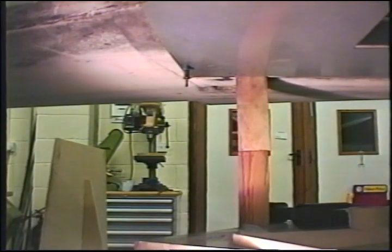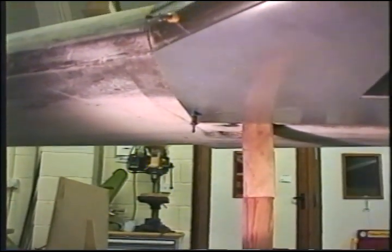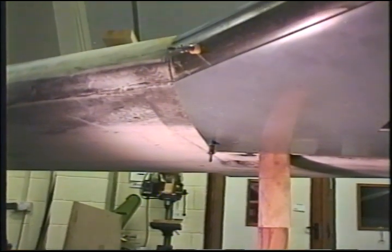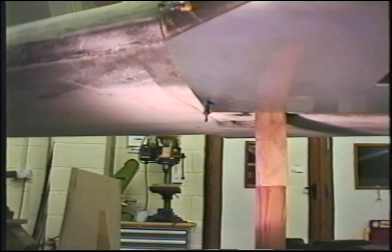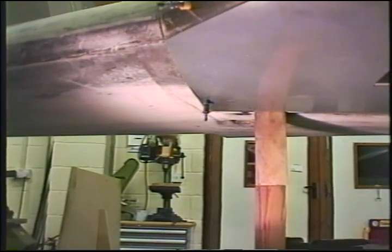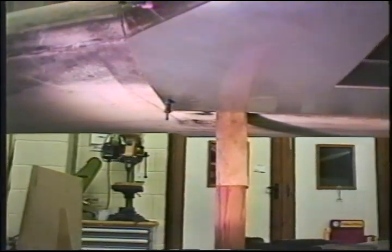There are going to be some things that you want to establish before you stick everything together. Leading edge, yep, I like that. Distance fore and aft, established with a cleco through a little forward section of your main spar where it's glass to glass. So that's a reference point. We're going to pull the wing off in a moment to make sure that we have access to everything as we clamp the main spar to the strake. But that's what you want to do.